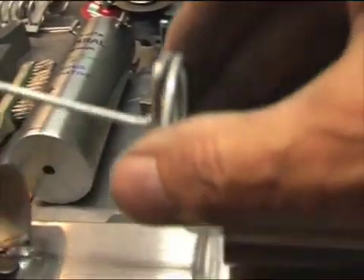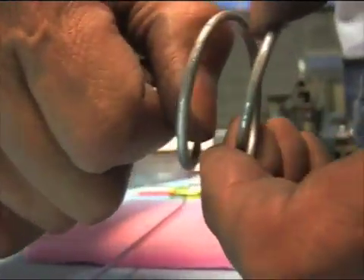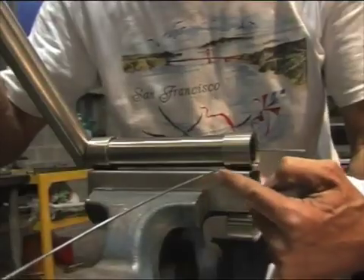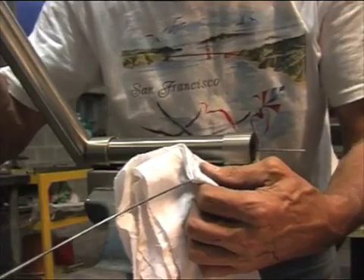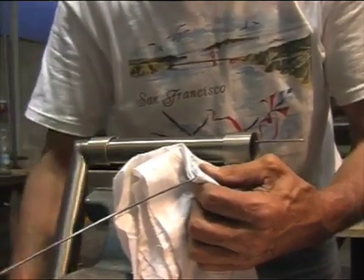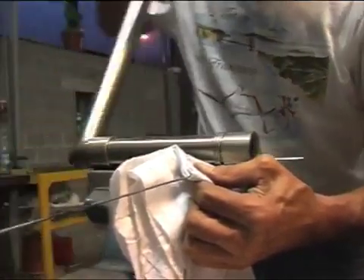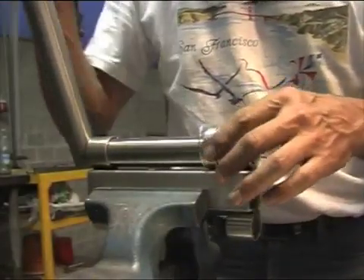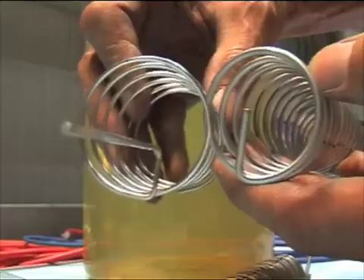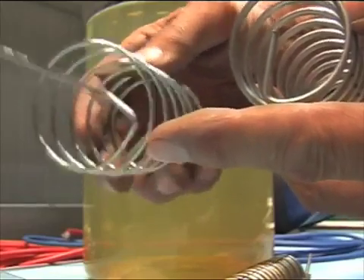You take it out like this. This spiral needs to be opened — it has to go like this. This is hard work to do on an eighth-of-an-inch stainless steel, I guarantee you that. And there you have your spiral. You have the wire that is inside; this is the other piece of the wire. I suggest you take a glove or a piece of cloth, and then you start. Steady speed — here we go. Here is the coil like this and you take it out. Every time it turns it gives a tick, and that's what you heard. It must tick, tick, tick every time it turns.